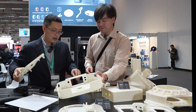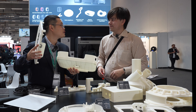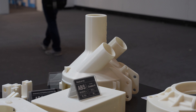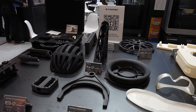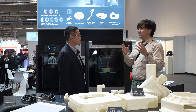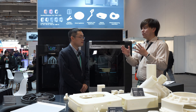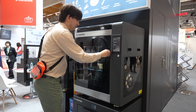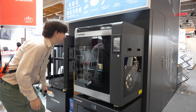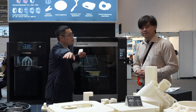What other materials can this machine handle? Normally people use PACF — carbon fiber material. One thing I've noticed is that if you don't have a heated chamber, ABS parts warp very badly. Yes — because this machine is used at the industry level, there's no chance to fail and print again. That is why we need to make it heated and print everything successfully the first time.